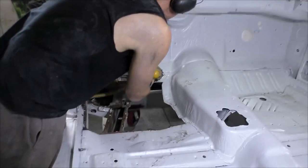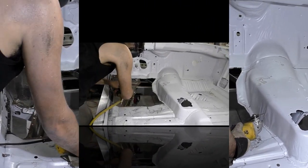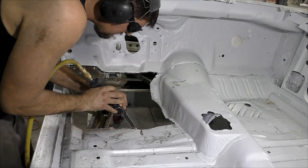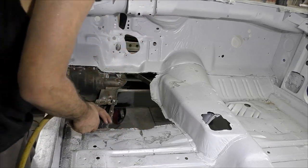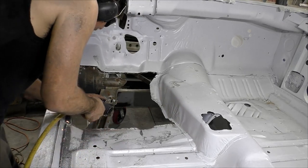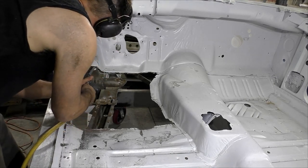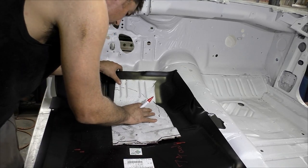During this process, the metal becomes like a razor blade, so I really recommend wearing some kind of glove. Right now I was wearing a TIG welding glove — an old one I don't use anymore — and they seem to work really well. Moving on, we're going to take the belt sander and basically prep all the areas where we just removed the floor pan patch. You've got to remember, we have all those spot welds still on the frame rails, the rocker panel, and everything else, which we'll just take with the belt sander and remove.